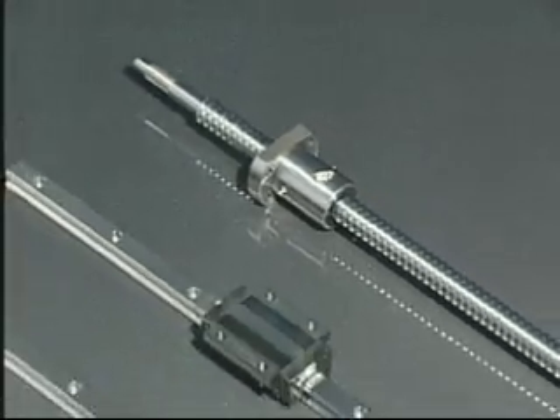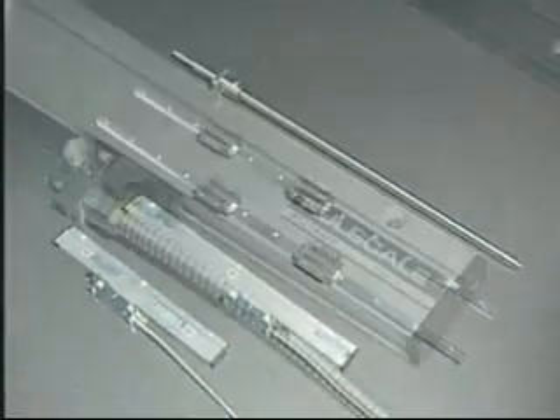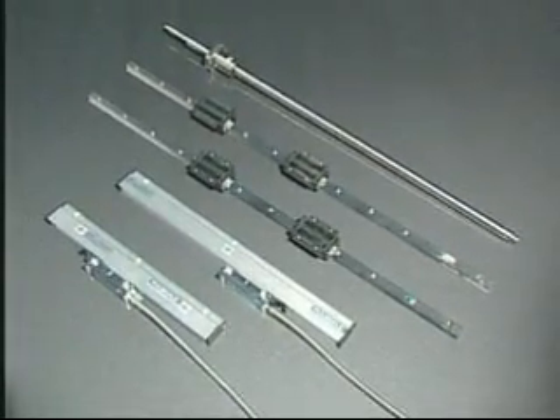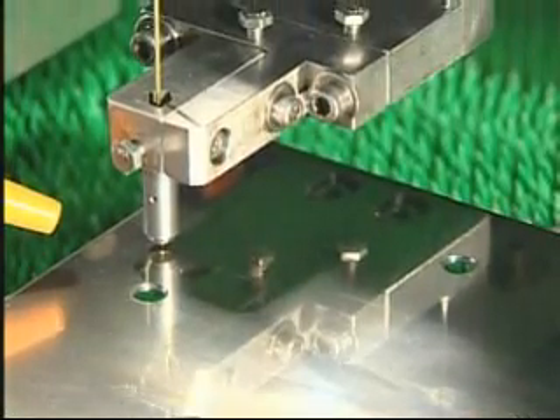TSH-3AA takes standard X, Y, and Z axes, DRO, and pulse scale for X and Y scale. It has 400 mm Z axis travel and a patented guide holder unit design for easy vertical alignment.